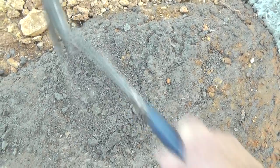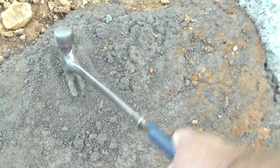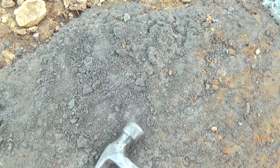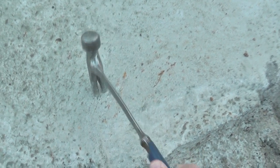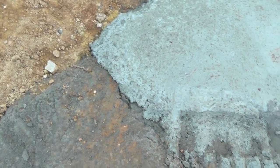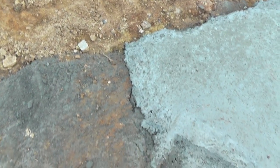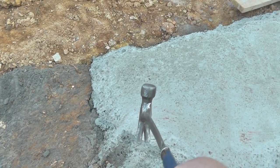it's actually designed to be able to dig through with a track hoe or backhoe, for something like street cuts, so that if you fill in a street cut and have to dig it back up, you can always do that. Now let's go to the normal concrete. So that's just a quick example of the differences. Flowable fill, regular concrete.